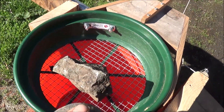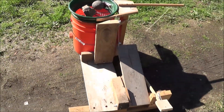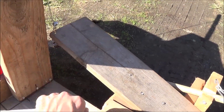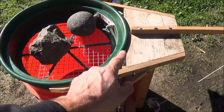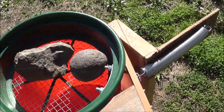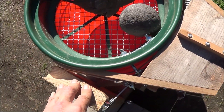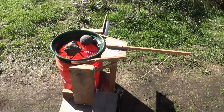For the demonstration, I'll set a couple of rocks inside so you can see how they move around. The next part is a secondary foot pedal on this side — you can see the angle to it. There's a hinge at the bottom, and off the top I have a cable going to a pulley that connects to a mount off the gold pan. Off the other side of that mount I have a spring — that's our return spring. When I push down on the pedal, the spring extends all the way out, and when I release, it pulls all the way back.